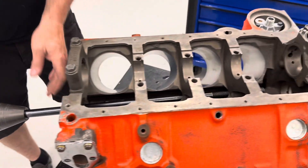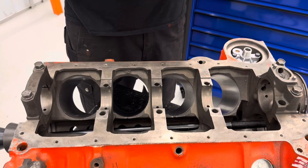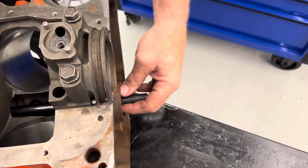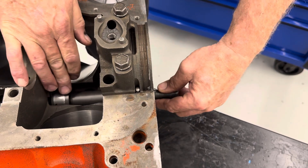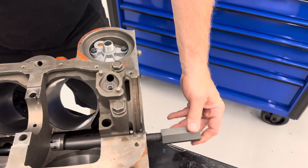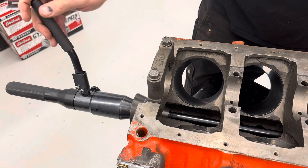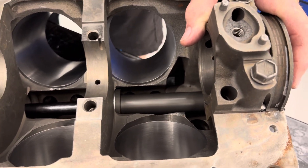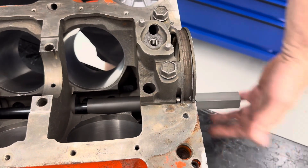I always put the number four bearing in first, so inserting the pump through number one and we put in the number four, because the four will slide through the five. Line up your arrow for the number four, take your supplied nut and spin it on the shaft. No smacking — so that number four is now in place. Spin the nut off.